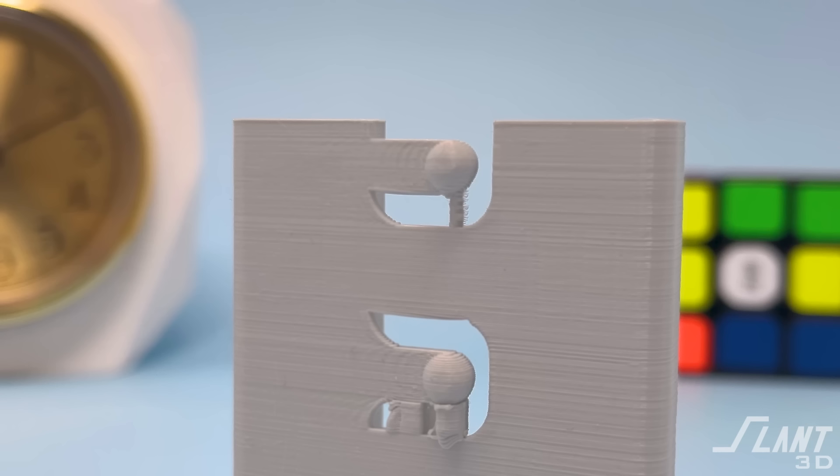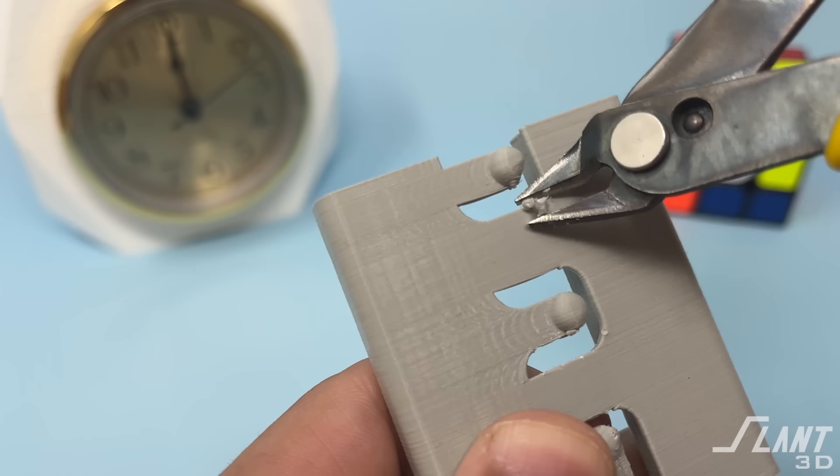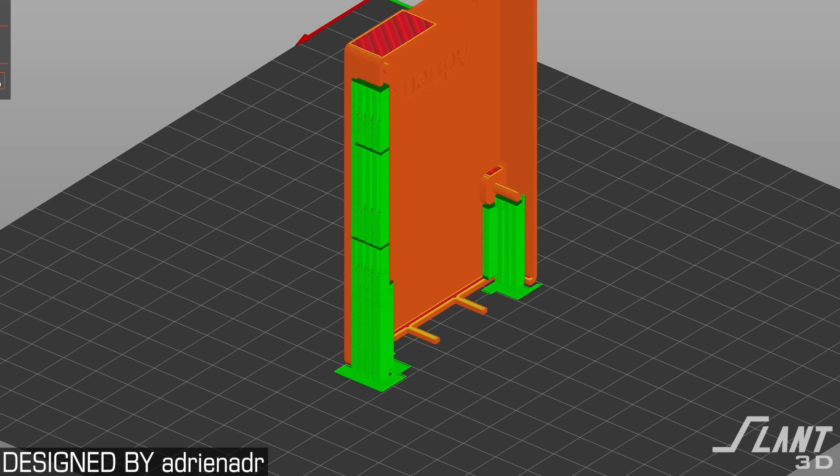In order to achieve this with a vertical orientation, you have the cutouts on the side of the part. I would engineer it with built-in designed supports — which would literally just be a sprue going from the bottom to the top so that it has a way to close that off, and then somebody can snip it out in production. Actually, we should do a design video on how to design these spacer sprues. This is sort of important to design these types of features. Otherwise we have to use generated support, and generated support is really bad for this kind of stuff because it doesn't create a very good result, uses extra material, and is a lot of extra effort. A designed sprue is more useful.